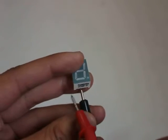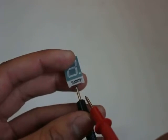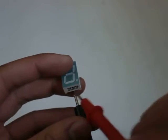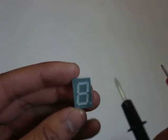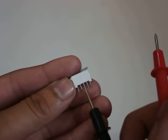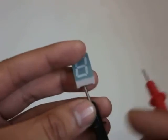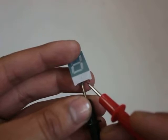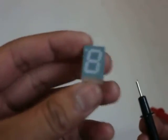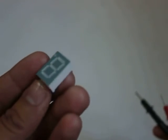You see pin 1 lights up. That means your lower half of the BCD 7-segment is working. Now we want to test the upper half — do the same. There are also 5 pins: 1, 2, 3, 4, and 5. Put the black one in the middle and the red one on each pin. You can see this is working, this is also working, this is also working. So the BCD 7-segment is completely working. You can test one using simply a multimeter. Thank you for watching.